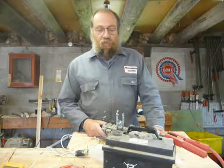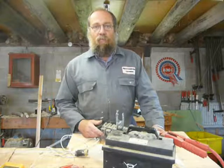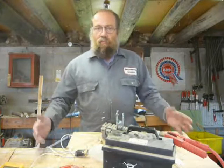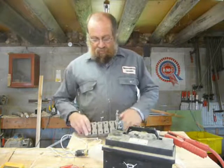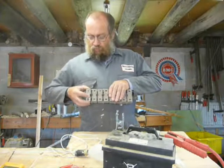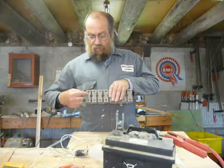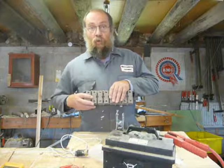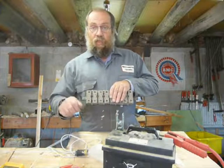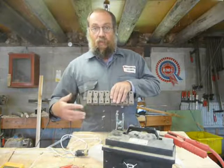This is about converting 48 volt DC to 12 volt DC, or tapping a 12 volt supply off a 48 volt DC battery bank. If you've got four 12 volt batteries in series you've got 48 volts. You can take 12 volts off just one battery, but the more current you take off, the more discharged that one will be, and over time there becomes an imbalance. In older milk floats where the lights were run on 12 volts, they used a three-way switch and every week the operator would flick it to put the lights onto a different set of batteries to try and get rid of this imbalance.